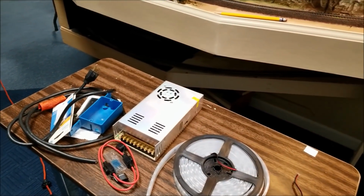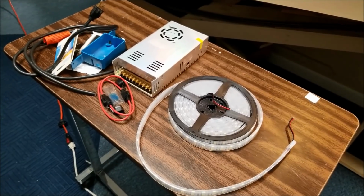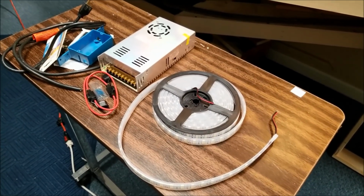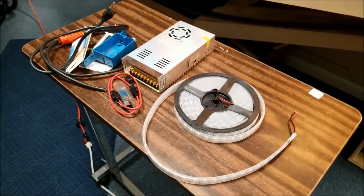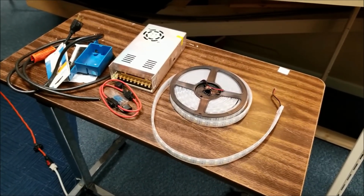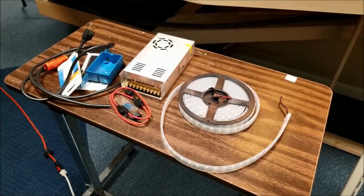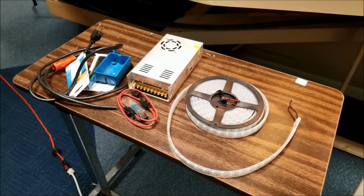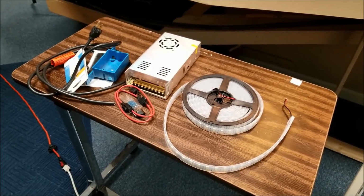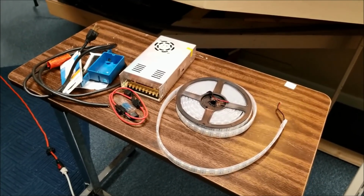And there's a plug right there on the wall to get our electric from, and that way I can feed both units, both sections, and that one power supply will take care of the two from the middle, and then we don't have an excessively long run, because there are limits on running this. So it is best that you use some type of bus wire to get to each section. It appears that you get out about 16 feet in length. From everything I'm seeing, you need to be running off another feed from the power supply. There is definite restrictions on all the instructions about getting out too long. You also get into situations where you'd be drawing too many amps, even with the LEDs.